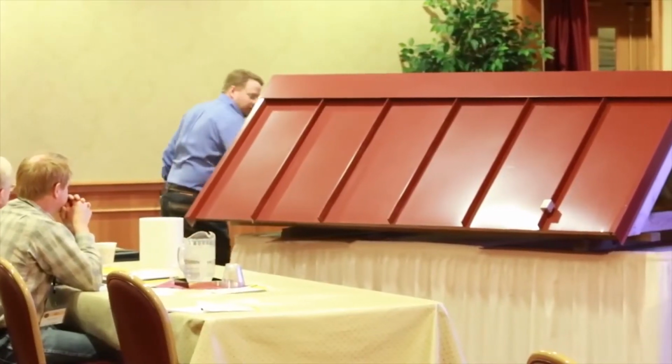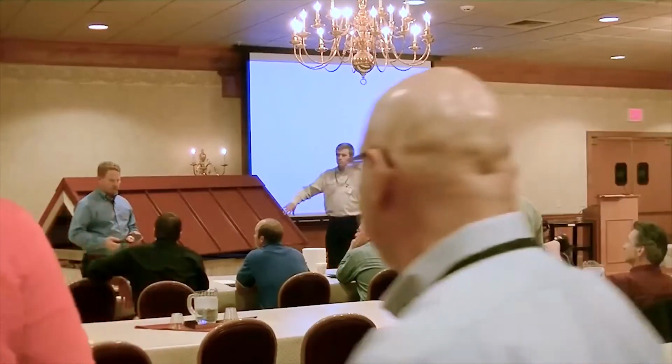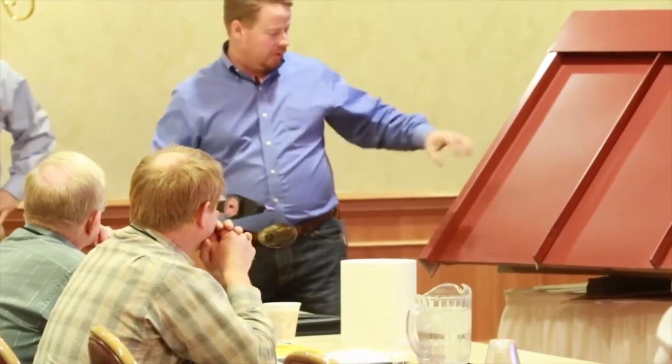Another tool that we've talked about and I wanted to show everyone, this is the torque wrench that we recommend. It's a dial indicating torque wrench. As you tighten a fastener, you can see what's happening on the dial. So you can see if you achieve torque, and then it'll instantly back off on a seam that is being compressed.